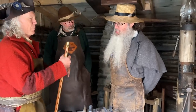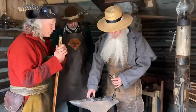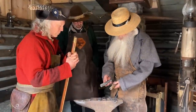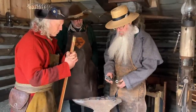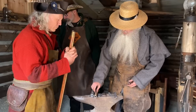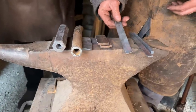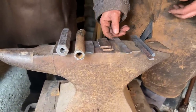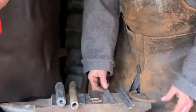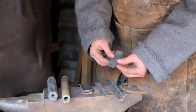Well, one of the methods they used to make these tomahawks is to reuse old gun barrels. So we've got a couple pieces of material here — a round tube and a hex one, which Peter's gun right there is hex. So we're going to try two different methods working through the process of making both of these into pipe tomahawks. This would have been wrought iron, so it wouldn't have been very hard, and we'll have to weld in a bit. They would save any kind of carbon steel they came across and reuse it in tools or axes. This is old spring steel, this is an old file, and this is carbon steel which I've prepped here.